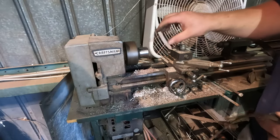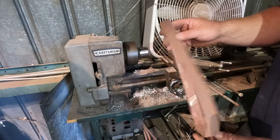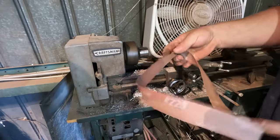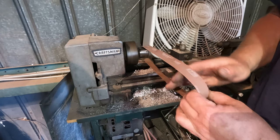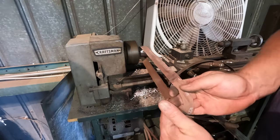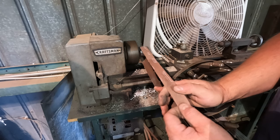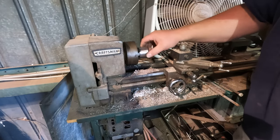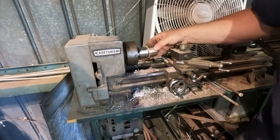This is the bushing that goes in the center. I want to clean up the OD, make sure there's no corrosion on it, and smooth it out because it looks like it's got a pretty good amount of wear. One quick way to do that — take one of the old belt sander belts you've been hoarding next to your belt sander. Flip it around so the sanding part is on the inside. You can pull on it and guide it around, and that works really well for sanding ODs. You can also rotate it to a new spot on the belt every once in a while. I can see some big grooves where dirt got in and gouged it around.